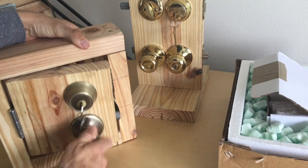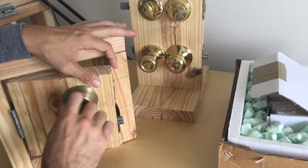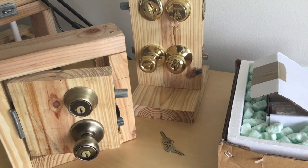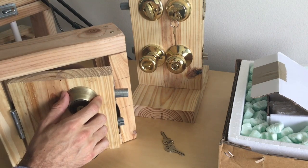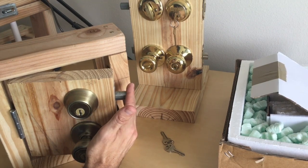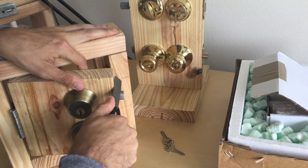To walk a deadbolt back — if a good deadbolt is properly installed and fully extends and locks itself out, you can't walk it back with a knife. Where this will work is if for some reason your frame is really short, or you just forget to turn your lock all the way. You turn it and it meets resistance but it's not fully locked out. You can feel you're hitting the bottom of your door frame, but the lock hasn't completely locked out. With that scenario, you can bite down on that bolt and start to walk it in.